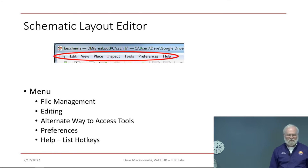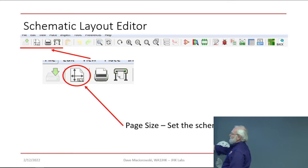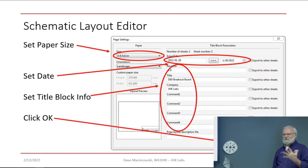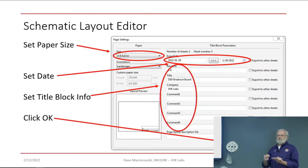I have a programmable keyboard at home — I took the whole left side and made it the hotkeys. First step: set the page size. How big is the schematic going to be? If it's small, just click page size and set it to 8.5 by 11. In this part of the world, A through E are the page sizes we use: A is 8.5 by 11, B is 11 by 17, then C, D, and E. When we were doing servers they were all D size — if you print them at 8.5 by 11 you need a magnifier. We used to plot D-size schematics.